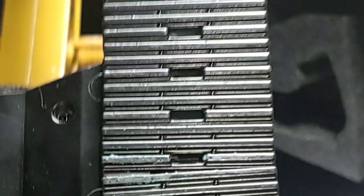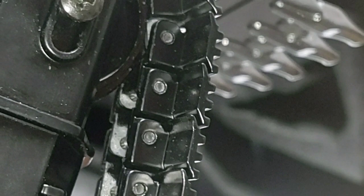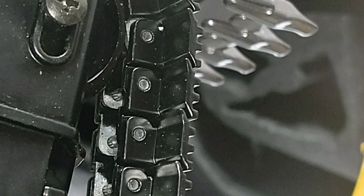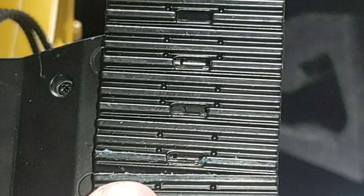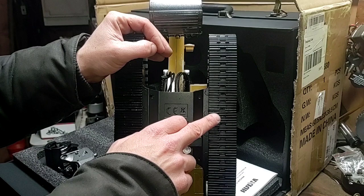Getting a closer look at our excavator — we definitely have a little bit of separation going on there. Looking at our links, you can see there are pinholes to connect them together with steel pins through the two halves. My guess is that one of the holes on the link is either broken, wallowed out, not connected properly — possibly a ripped or broken link. A bit of a bummer. I marked it off with some green crayon right here.